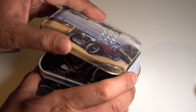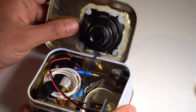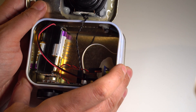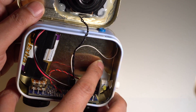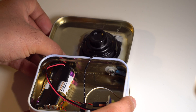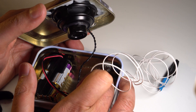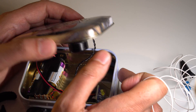Inside here it's just epoxied there to make it airtight. And inside there is the antenna. It's quite spacious — there's lots of room inside and everything fits quite nicely. I used some Polydough there to hold that circuit board in place. The antenna can just be plugged in here. The antenna connector needs to be insulated from the metal can, so you need to find a way to do that if the socket isn't already insulated.